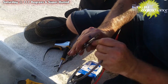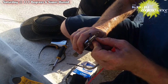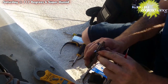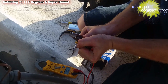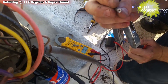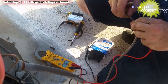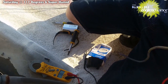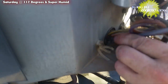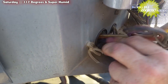Now some people say use wire strippers, but the point with any wire stripping job is not to lose any strands. If you lose strands, that's a place for heat to build up. If you do it by hand, you just want to check to make sure you don't cut off any strands — you can look inside and see. With bigger wire sizes, they're usually stripped with a knife. We're going to take this end and run it back through to the compressor.